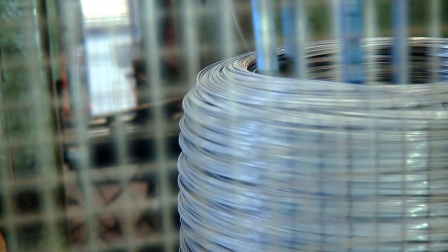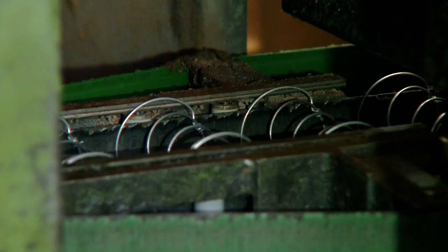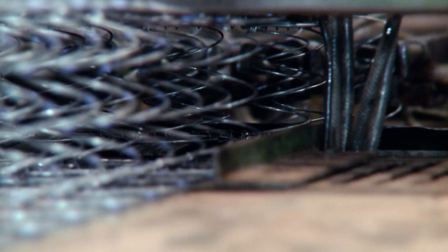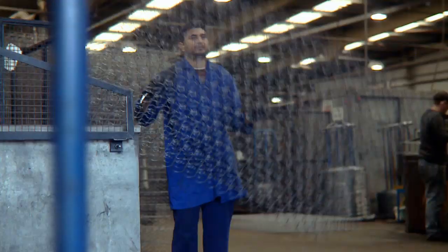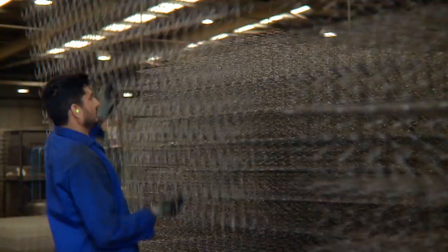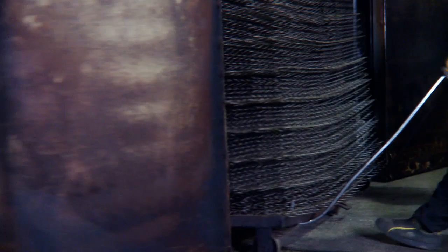The coils are made from high tensile wire and automatically assembled. Once the spring units have been assembled, they are heat set in an oven for 45 minutes. This process ensures the spring unit maintains its shape and produces a more durable unit, providing firmer support.